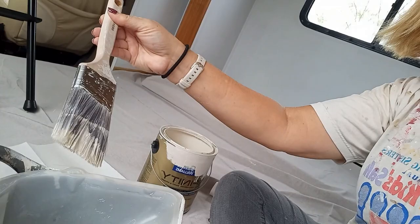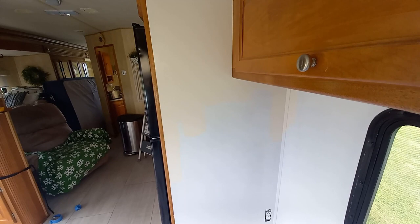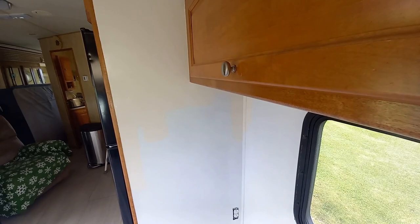I went ahead and got a little bit nicer brush out. Again, I like the angled, curved one. My handy pail. I got a new roller out since it's a new color and I de-shagged it with my tape. Now the important part of painting is to always keep a wet edge. So as you can see, I am trimming in the sides, cutting them in, and then as I have a certain portion done, I will go ahead and roll that so that you always keep a wet edge going. Otherwise, you may lift off some of the paint as it dries and it'll give you those streak marks on your finish coat. Or you can cut in the whole thing and once it's dry, you can roll it all — whatever your preference. But don't cut it in while it's still damp and then roll over it, because it'll leave marks and you'll notice the roller marks and it won't look as good. So keep that wet edge.